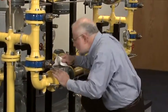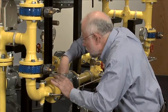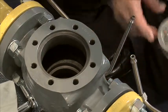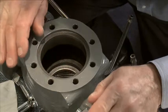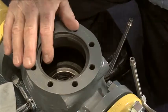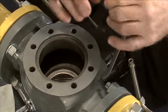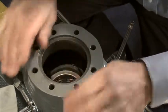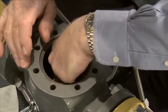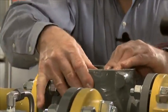Before we put these parts in, we want to make sure the body doesn't have any foreign material or objects in it — we're going to wipe out any grease or dirt that may have built up inside the body. We look clean in there. First thing that goes in is the strainer basket. If your EZR doesn't have a strainer, there's a shim of about the same thickness that makes the stack height right — it's very important that you do not put both the strainer and the shim in, you only need one. The O-ring is the next part, and we'll put a little bit of grease on that. Then the cage — just drop that right down into the body and make sure it seats on that O-ring.